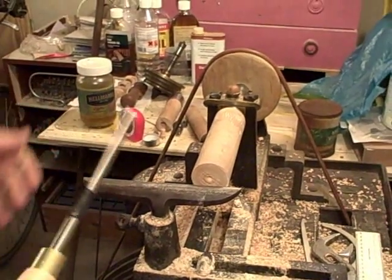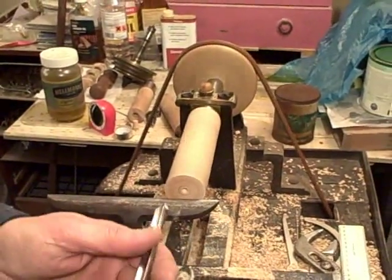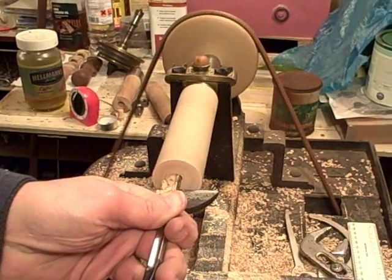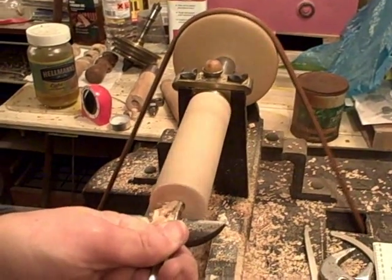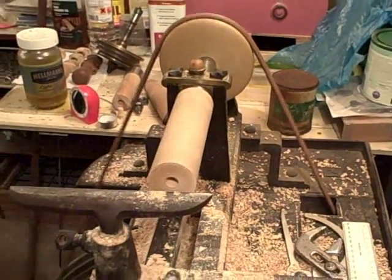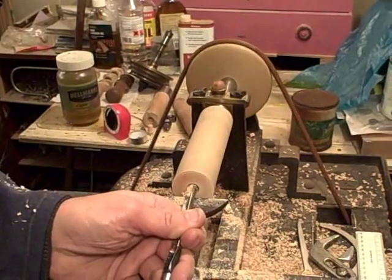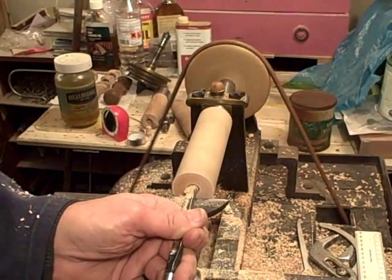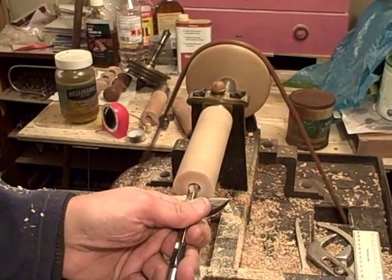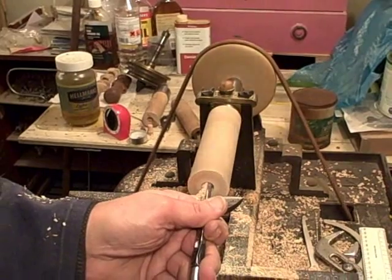So the idea now is to bore down that hole there — or rather turn, as in the instruction we were talking about before. I need a bit of pressure on this one, because as you noticed before it struggled to go in. We are turning beech here, and this is a particularly hard wood to get into. When you put pressure on like that, you're also putting a lot of heat on that tool — so I'll just pull that out for a moment, clearing away the waste. I can feel how hot that's getting. The reason why I think this is the way it was done is because when we looked inside the bottles at the Leeds Armouries, you could see a kind of spirally groovy effect on the inside — I suspect that is the spindle gouge being removed as the neck is opened out just a little bit.